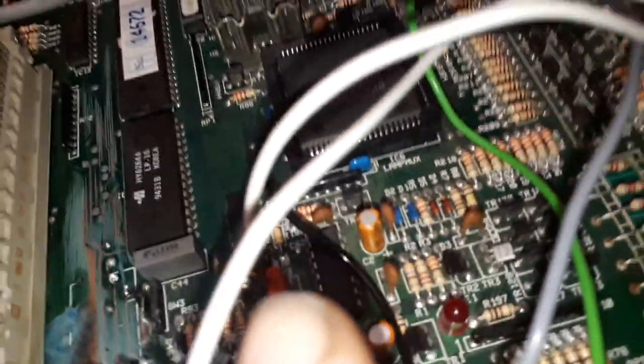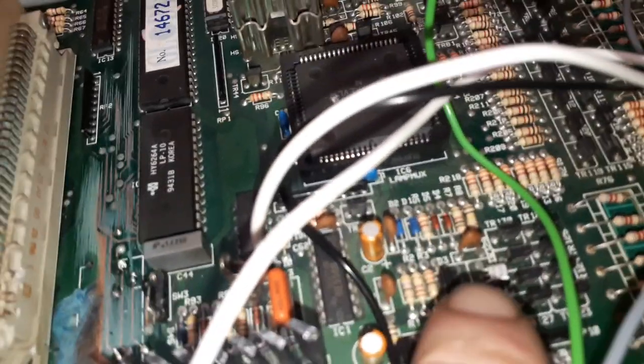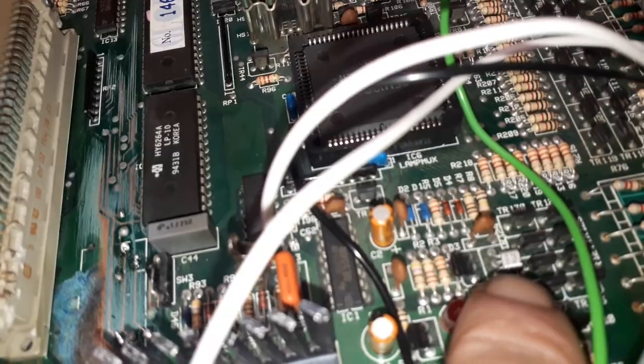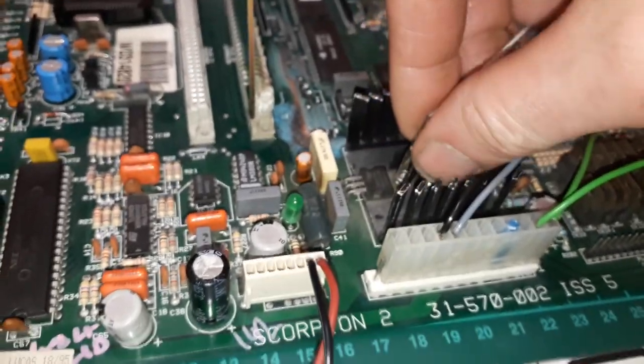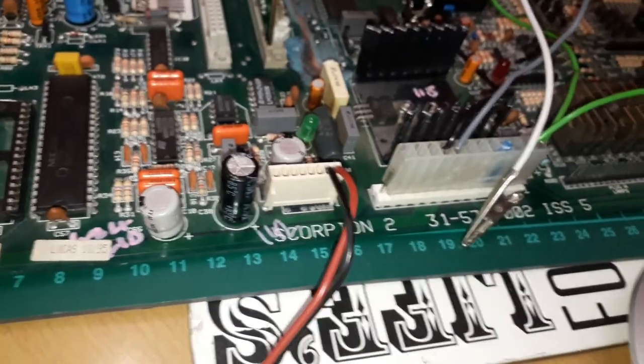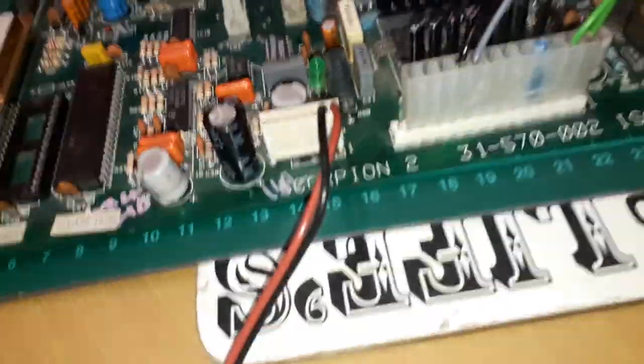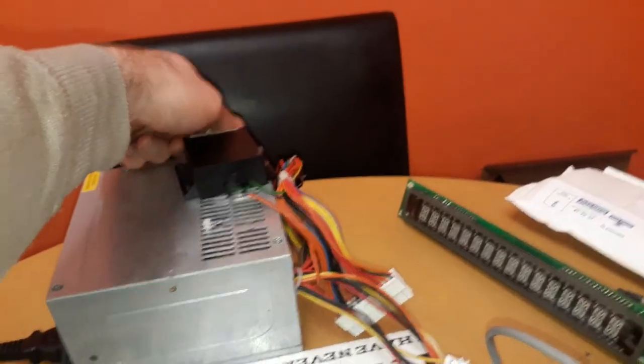And it works as well if I take the reset bypass off and then I just close down the VMM transistor. The watchdog can run by itself. I mean, I can probably show that as well. If I just take the ground off, that'll bring the reset circuit back into play. It's quite handy having a little popper switch here.